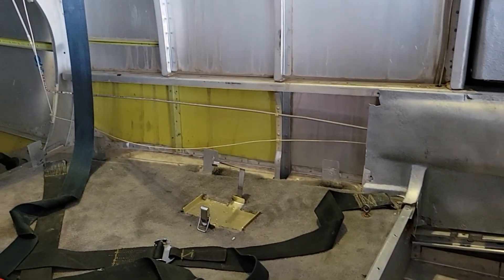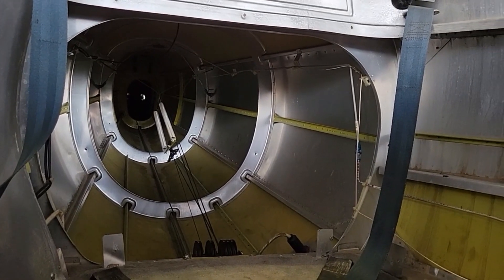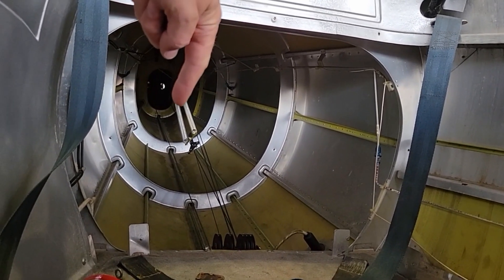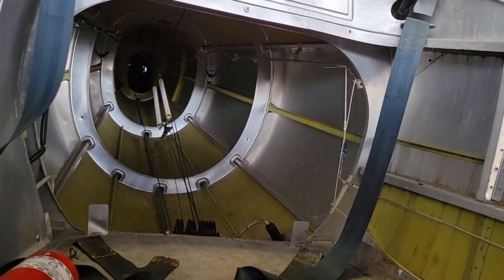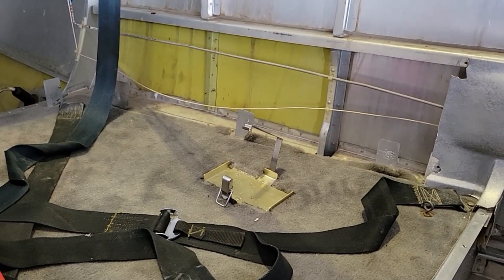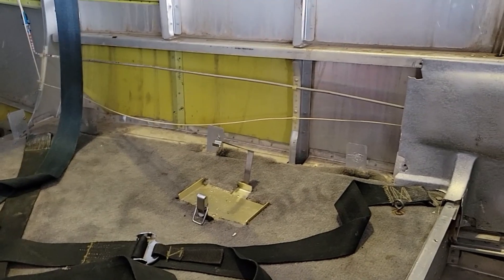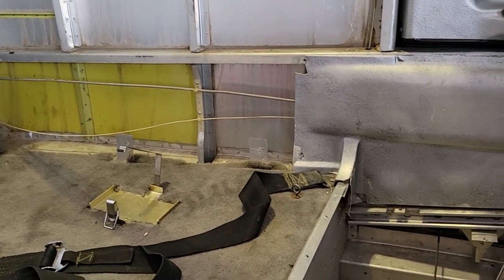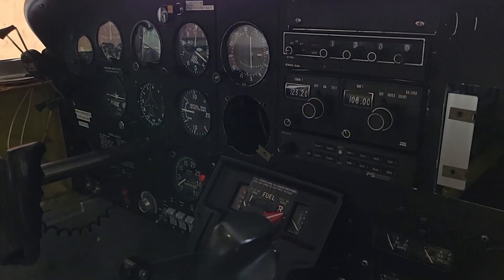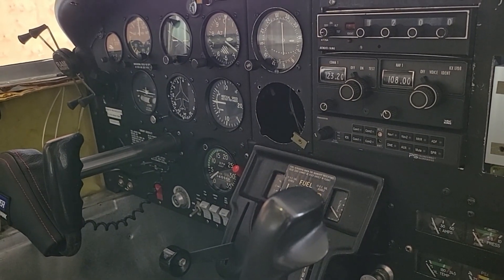One of the things I really like about the Southern Alberta climate is just how little moisture we get. Looking down the tunnel of the fuselage, you can see how clean that aluminum is — that's aluminum straight from 1979. One of the items that had to get covered off in the annual inspection are those trim springs. They are a time-limited component, so those had to get replaced. Also, you can see the ELT bracket from the old ELT. Right when I bought the aircraft, there was a shop that certified that ELT for two years, but there was actually an internal fault in it, so it was junk. We had to get a new 406 MHz ELT, which will be mounted under the pilot seat, moving it out of the cargo bay. The remote switch for that ELT is going to be installed where this unused instrument location is, so a new mounting plate and switch are going to be set up there.